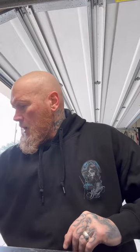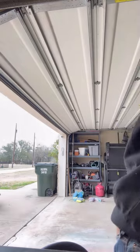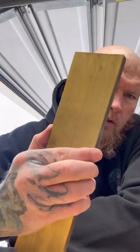And this is 1/2 inch thick and 3 inches wide. And you'll need at least a 4-inch piece to make a pair of brass knuckles. Let me confirm that with you guys before. 5 inches. So you at least need 1/2 inch thick, could be thinner. I like 1/2 inch thick, 3 inches wide and 5 inches long to make a pair of 4-finger knuckles. And so first thing is a piece of brass.